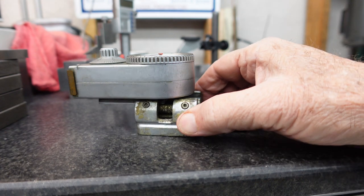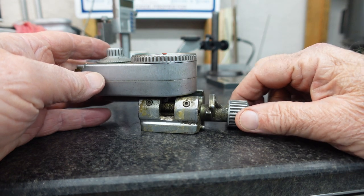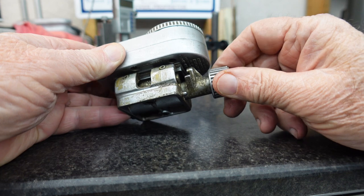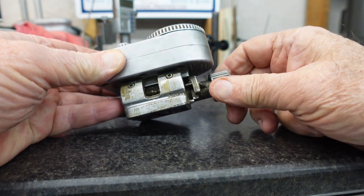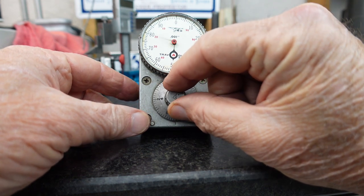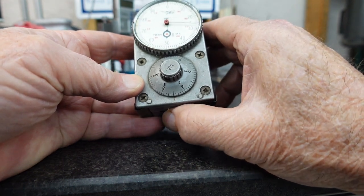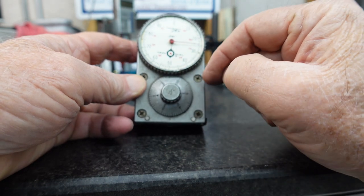So what we have here on the surface plate is another travel dial that I have — it's not on my machines but it has a mounting bracket. This is just a spare that I have that's filthy, and it mounts on a dovetail on the mounting bracket. There are set screws to lock it in place, and there's a unit here that you can screw and adjust where it rides on the dovetail. The unit itself reads in thousandths and has a dial that reads in inches and tenths of an inch.